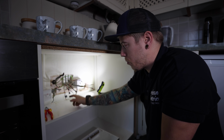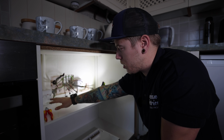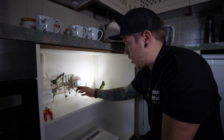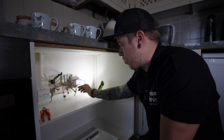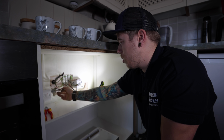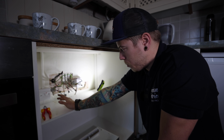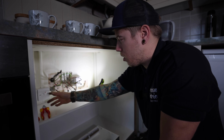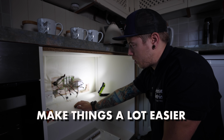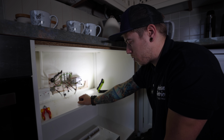We're going to drill through for the EV cable, and then these circuits here, this is the cooker cable going to the isolator, you've got another cable here going to the hob, and you've got another one going to the extract fan. They're all so close, I'm just going to change these at the isolators. It's just going to make things a lot easier when I'm putting the board back. I've got a nice length on the cables to dress in.